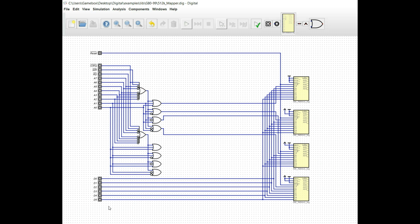And in order to do that, we are going to have to use a second set of chip selects here, but utilizing the read pin. And of course it comes down here and it's factored into this second 8 input OR gate, and then the last 2 address bits are also factored into the 3 input OR gates. So it's the same scheme, we're going about it a slightly different way. The way that we have done this, obviously we have, I believe, 6 flip-flops within each one of these registers.